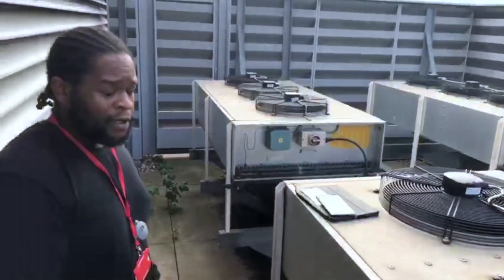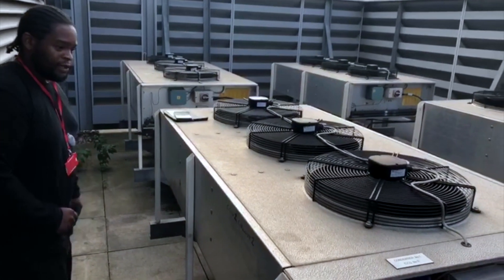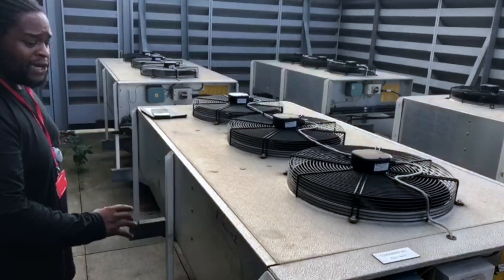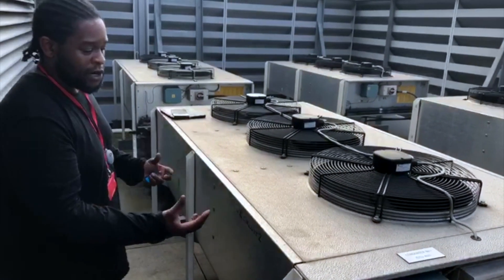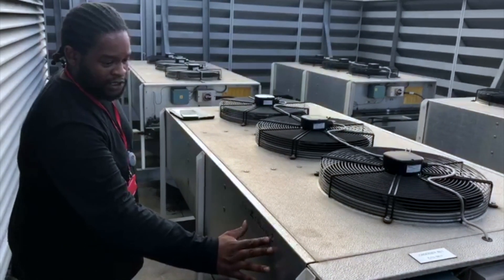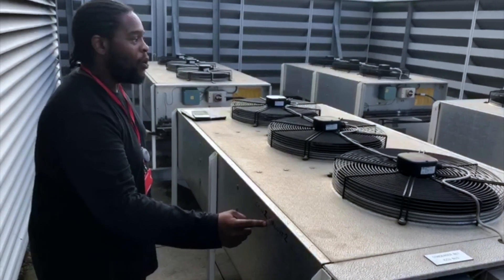On this service, I've managed to identify which circuit is which by running one circuit in manual, leaving the other in manual off, and coming up here to see what's running. I've now labelled this — this is circuit two of close control unit one.